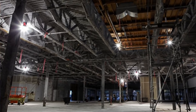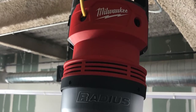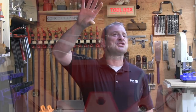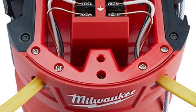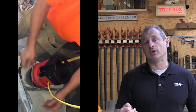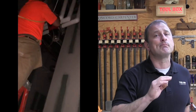Milwaukee really thought this through, especially on the wiring — they have a built-in chase in the terminal block that makes it so fast and easy to use. While our Romex cable system wasn't daisy-chained, the 2155 comes ready for back-to-back terminal block daisy chaining. Hanging the fixture on the ceiling is simple: Milwaukee uses an integrated cable connected to one side — you loop it around, slide it through a snap-in fitting, and it works beautifully.